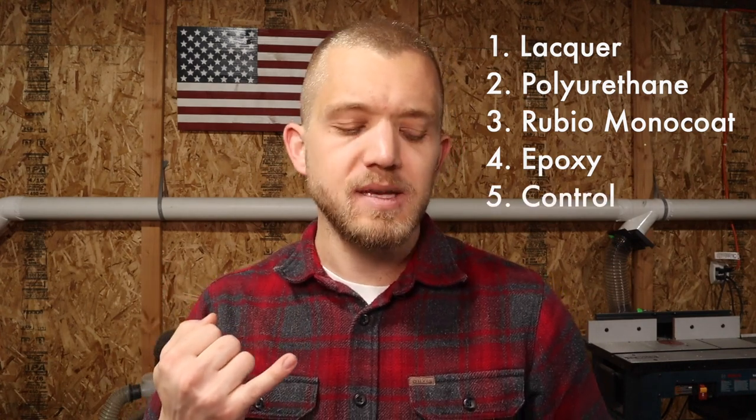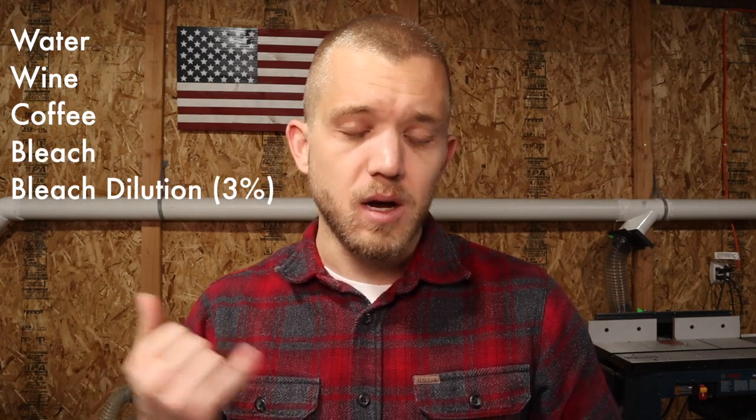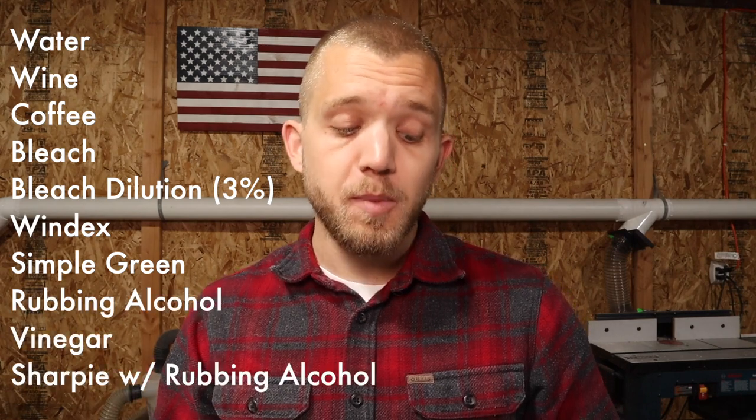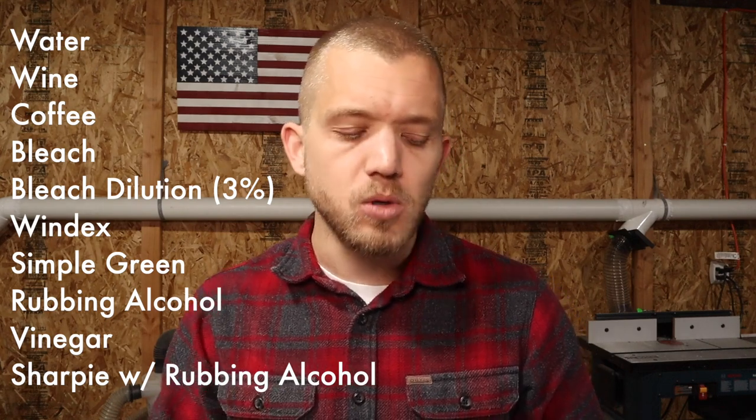So today I'm going to go through and do a torture test with a whole bunch of different finishes. We've got lacquer, polyurethane, Rubio Monocoat, and then an epoxy finish. We're also going to have a control in there so that we can see how the raw wood does by itself. Then we're going to run all of them through a series of torture tests, which include water, wine, coffee, bleach, bleach dilution for disinfecting, Windex, Simple Green, rubbing alcohol, vinegar, and Sharpie with rubbing alcohol removal, to simulate if you've got a kid and they put Sharpie on it, and you're trying to remove it with rubbing alcohol, to see how well that holds up.